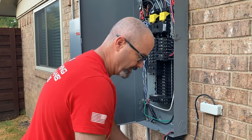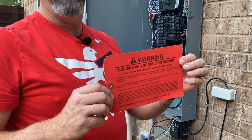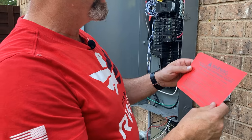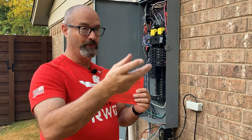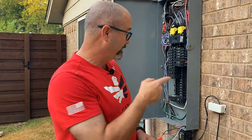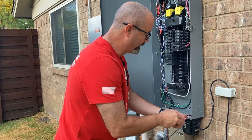One thing I noticed when I unpackaged the FS 140: look at this big red tag. Some of you know this — inspectors hand you one of these when you do bad work. But what it's flagging here is a bonding and grounding hazard. Basically, the service you're installing this surge protector into must have a ground or a neutral-to-ground bond. Several people have messaged me that where they live — in regions primarily running 220 — there's no neutral and no ground. Without a service ground, Siemens says their surge protector may not work, because we're using ground to shunt that horrible voltage out of the house.